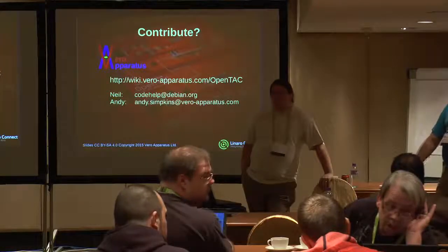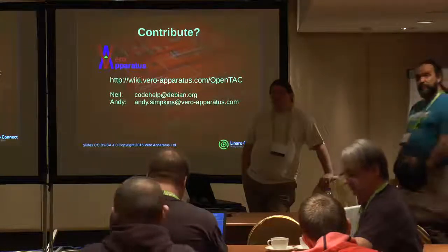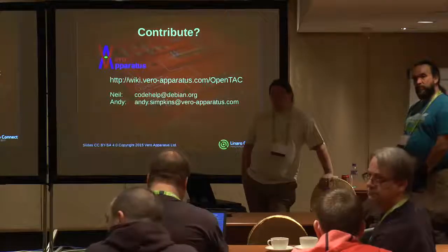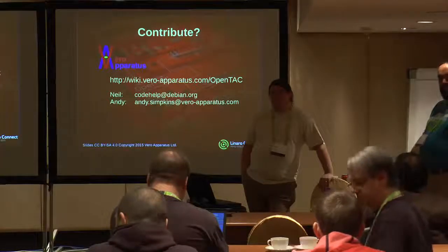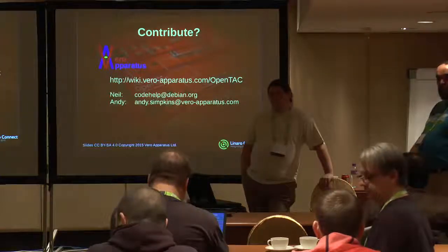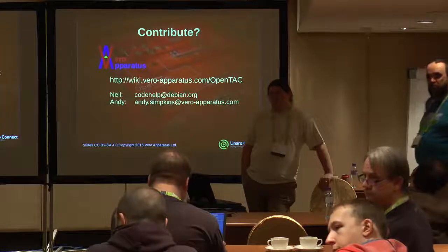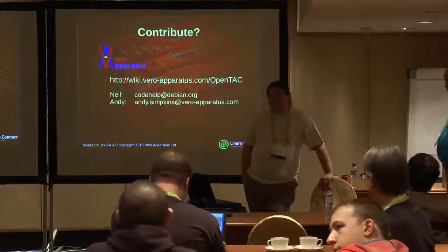Right now we use a box that is Ethernet controlled. It's a web server. It costs around $80, and it gives you 8 relay ports, and that's what we use to switch the boards in our farm. And in the case of USB, we put an extra relay in the USB power cable, because the relays have normally open, normally closed contacts. So with one relay we can do both at the same time. The only thing that we don't get is the serial interface, but for that we use a commercial USB to serial. Indeed. That is a perfectly valid solution.